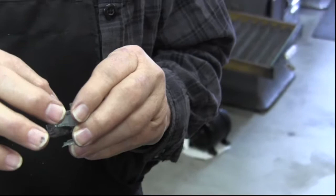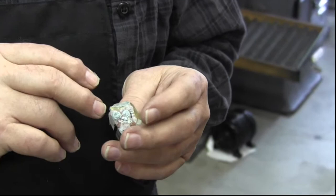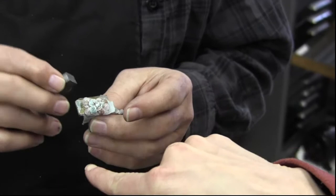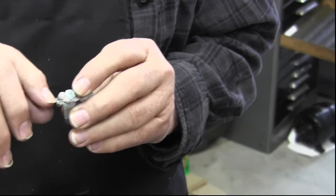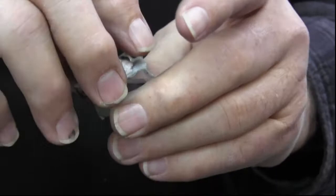And then you cover it up with tape and then cover it in wax. And then you submerge this into the tank with electricity going through it, so it builds up, and it builds only the typeface part, and you can pop the rest of this off. This mat itself was protected by this tape, so it didn't grow on that. It only grew in that hole. Once it gets finished growing, you cut this off, and you take the type off on the other side, and then you have a new mat that you can cast from.